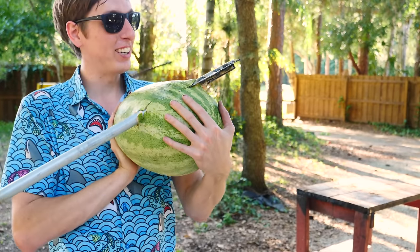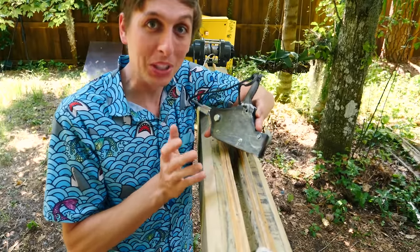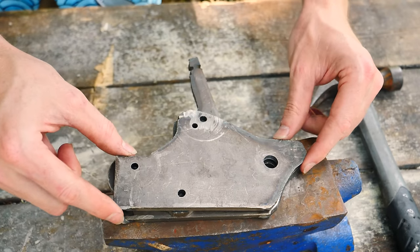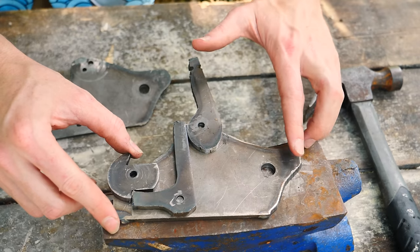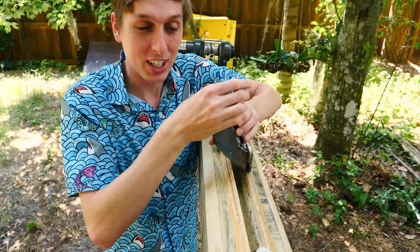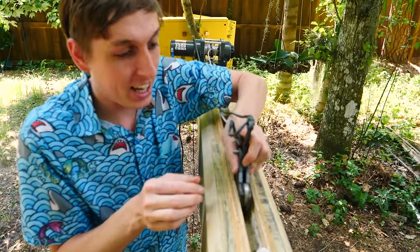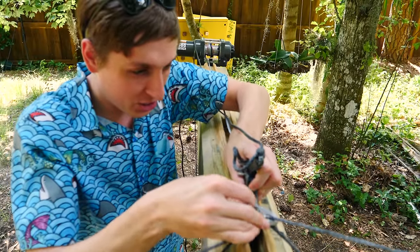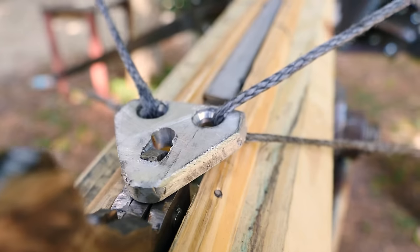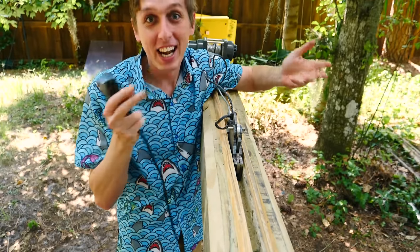I guess now we can move on to something a little bit harder. I never really explained how I'm triggering this thing, but it's pretty simple. This is the trigger I'm using — it's a very simple mechanism. When I pull this cam back, it kind of forces this lever to go down and it releases this spinny thing which releases the arrow. I have the trigger here, it goes in this long slot, a little bit deeper than the arrow, and then you basically push the string up onto here. Use the winch to pull it back, then all you have to do is pull this lever and the arrow is released.